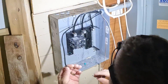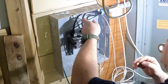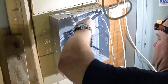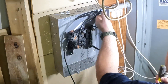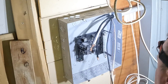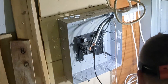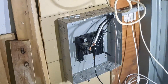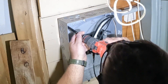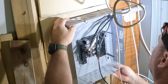Without doing these electrical upgrades, it would be impossible to have delivered these two new circuits safely. So what we're going to do is put the air handler — which is a 240-volt air handler; there aren't many of them that are 240 volts anymore, but this one is — inside the subpanel. And the condensing unit wiring will go in the main breaker panel because that's an inductive load that draws a lot of electrical power. That's why we're putting it in the 200-amp main breaker panel right to my right.